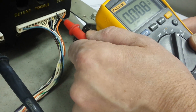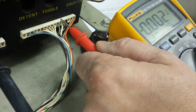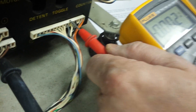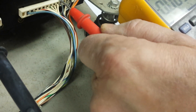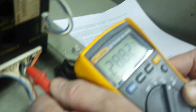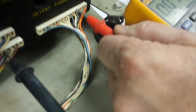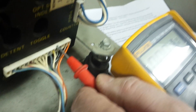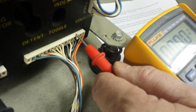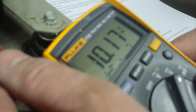Pin 3 is open. Pin 4 is black with no reading. Pin 5 is gray — this is the inner cam switch, no reading there. Pin 6 is the other cam switch. Counting across: 1, 2, 3, 4, 5, 6 — right here. That should be eight volts. Pin 6 is the outer cam.